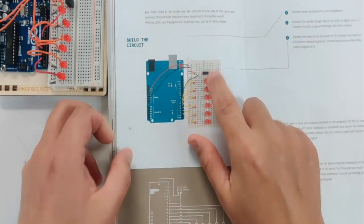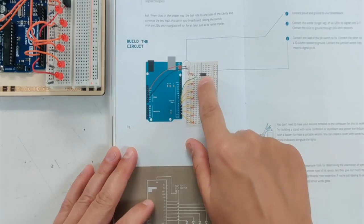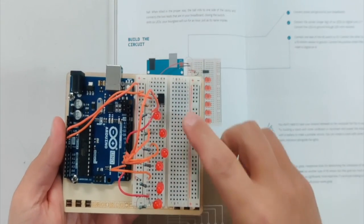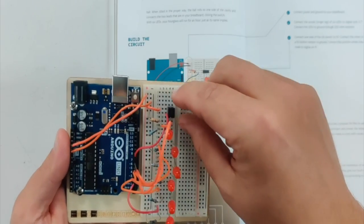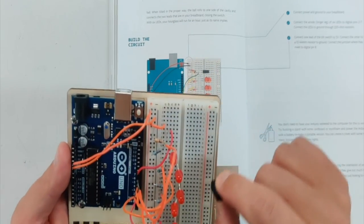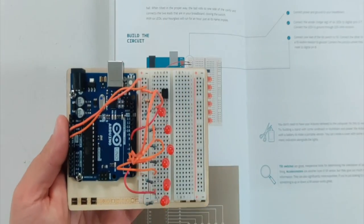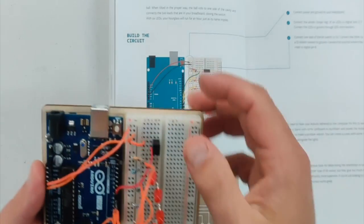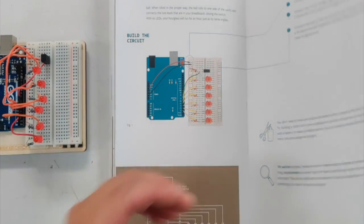The book is very useful here. The diagram doesn't do a good job of showing how the tilt switch is connected. In my connection, I've connected it like this — you can see there. I used those four pins and put them right there. There's a note that says 'facing up' — that's how I've connected this. Be careful with that; if you're not watching closely you'll run into trouble.